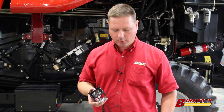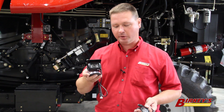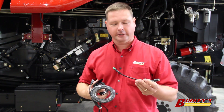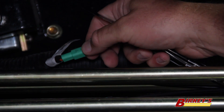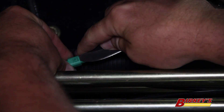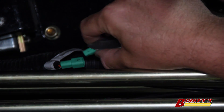Berkey's offers several camera systems compatible with a camera-ready machine. One of the most cost-effective options is our VisionWorks camera system. For $165 you can get a camera with magnetic mount, an extension cable to run it anywhere on the machine, and an adapter cable specific to mid-range or flagship combines that plugs into the green connections we just showed you. When the machine comes from the factory it will have plugs installed in each connection. To remove them, take a fine blade such as a pocket knife, insert it in the front edge, and lift up on that square tab — being careful not to break it — and you should be able to slide the plug right out.